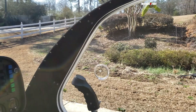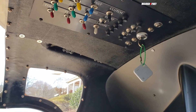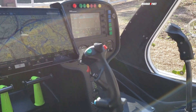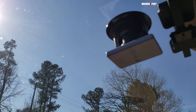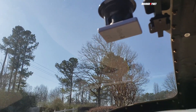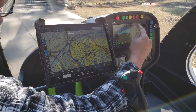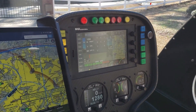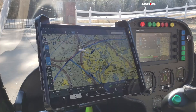Another thing you should know is that this A600 is ADS-B compliant. As you know, the FAA requires that if you're going to fly in certain airspaces you have to have the right equipment, and this aircraft has it. The ADS-B equipment helps with ADS-B in, and the data from that transmits to ForeFlight on screen, which helps you see traffic and things like that. So with this aircraft you've got ADS-B in and out. Just about everybody uses ForeFlight because it's just an amazing app.